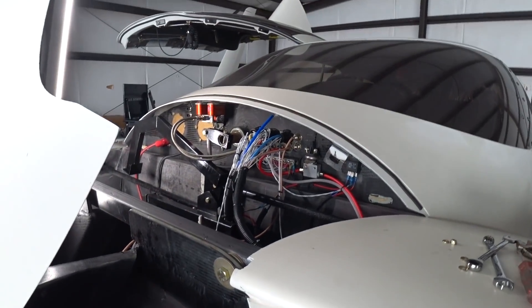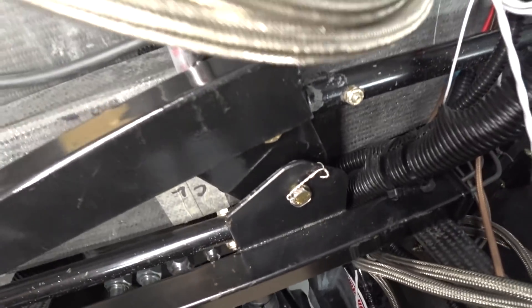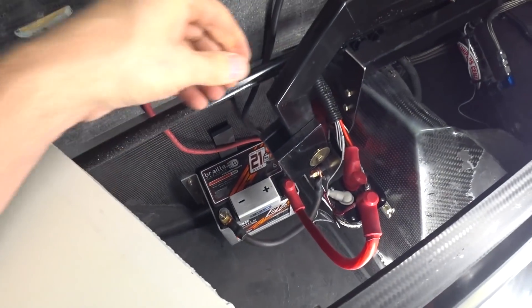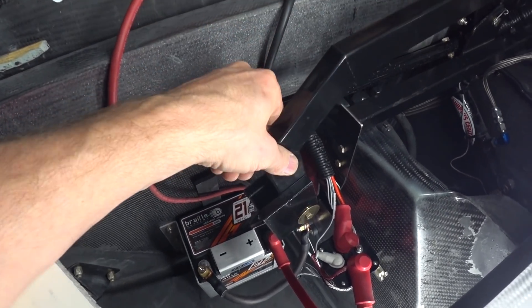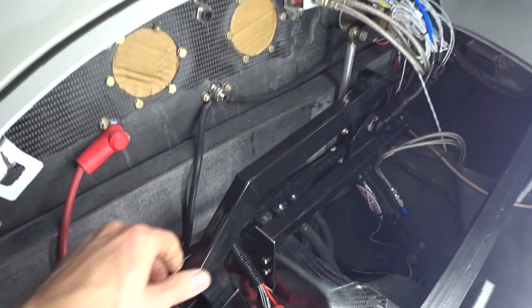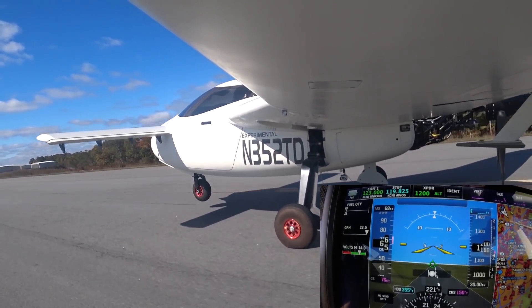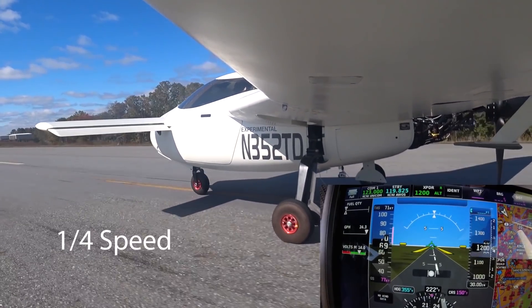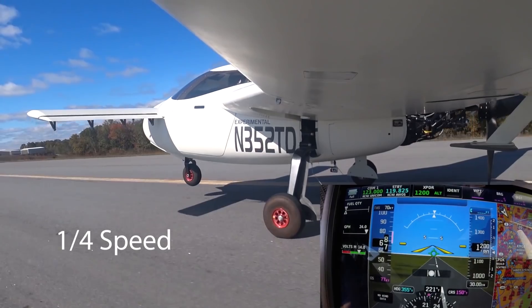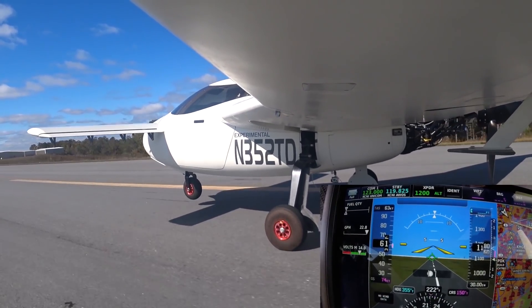With everything done you can see I've safety-wired the main bolt so it won't come undone, the counterweights are bolted up, there's no fore-aft movement — it's nice and rigid and just moves up and down the way it's supposed to. Before we do the drop test, let's look back at how things were when I had the nose off: when the nose came down the elevator bounced to almost full down deflection. The nose comes up, I say okay nose down, pull the elevator up, then when it hits the ground the elevator goes down again — and I didn't do that, it did it basically by itself.